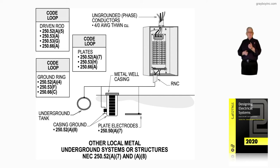You might have plate electrodes, or you might have an underground tank — but you'd want to check what kind of tank it is. Does it contain gasoline? You may also have a metal well casing, and based on that casing you might be reading two to three ohms on that grounding electrode conductor. What this illustration is showing is that you would ground to these other local metal-type electrodes where the preferred electrodes are not present or available to you.